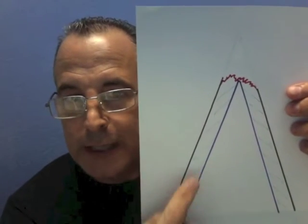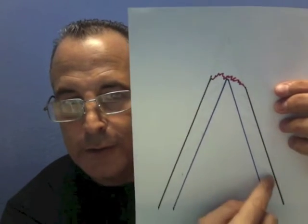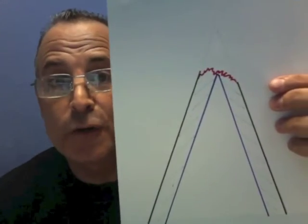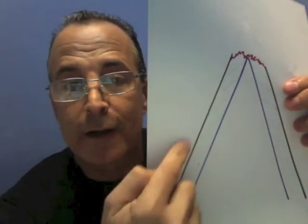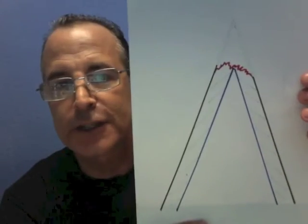What we do is take it back to the stones, and we have to knock off this metal here, the little green lines, to make this thing pointy again. So we have to remove steel to bring the point back. When the edge gets crumbled like this, we can't just push it back out. You've got to remove the metal here from the sides to make it pointy again. Now, that's what most people will talk about as setting the bevel. Okay, so we'll go with that definition. That's setting the bevel, what I call sharpening, or just making it pointy again.